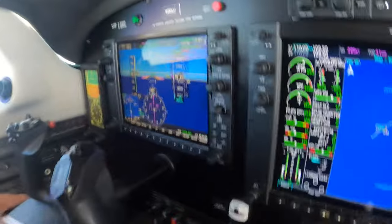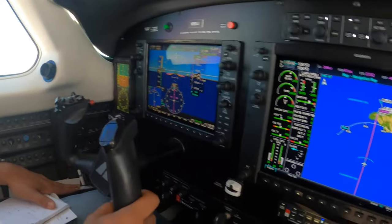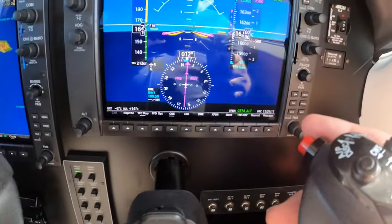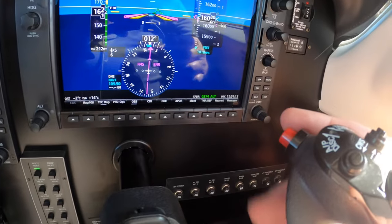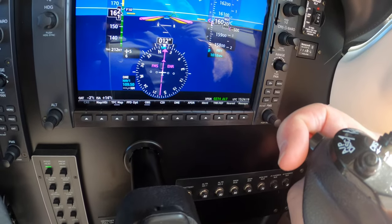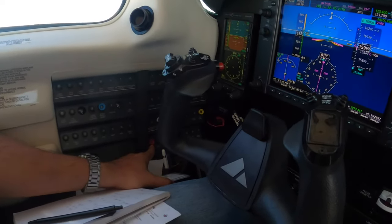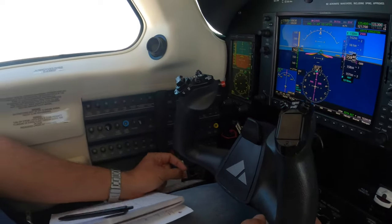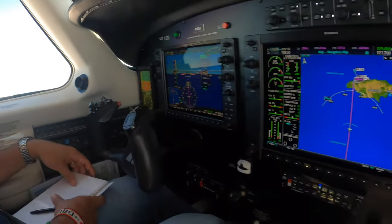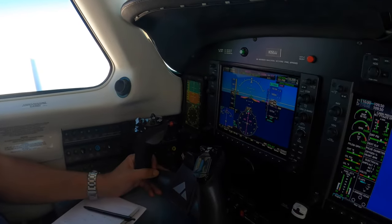To that end, we have a red autopilot disconnect. But in order for this to work correctly, when the autopilot misbehaves, don't think about which axis is misbehaving — press and hold the red autopilot disconnect, and then find and pull the breaker for the pitch trim. It has a red cap on it; we put that red cap on so we can find that breaker quickly. You also can't have any charts or anything in front of that breaker — it needs to be seen.